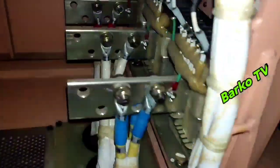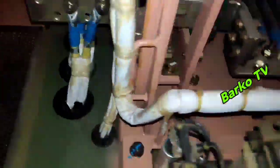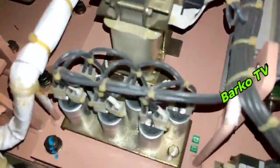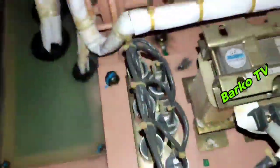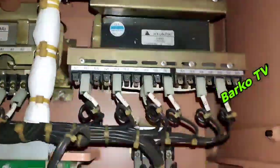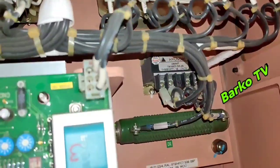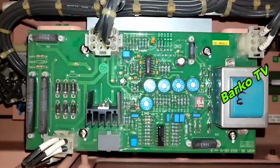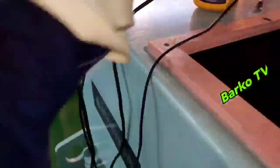These are the terminals — the main winding terminals at the top of the alternator. We need to familiarize ourselves with the components: the current transformers, capacitors, reactors, and the terminals. On the other side is the AVR. We need to familiarize ourselves with the AVR and then disconnect the three connectors x1, x2, x3 for safety.